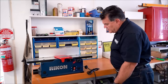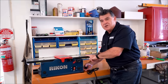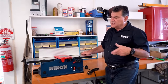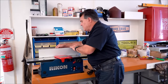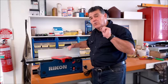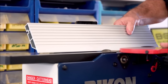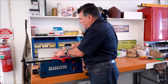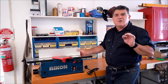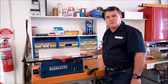To adjust the head, basically you loosen the knob and wind it up or down to increase or decrease — a maximum of 3mm. But really if you were doing the full width you wouldn't do 3mm; it depends on what kind of timber, as some are harder than others. You've also got the little fence you can move in and out and lock in position, and you can actually tilt it. It's easy to tilt to 45 degrees. And it goes back to square straight away so you don't have to readjust it all the time. Perfectly perfect for the small shop, for those guys who just want to do little jobs. Come and have a look at the Rikon 20-600.